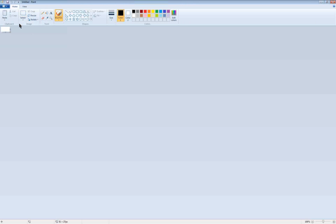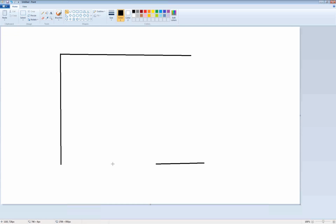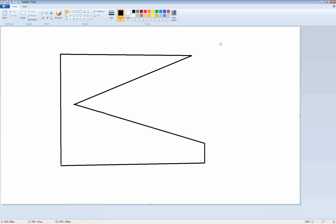So if you have a part, for example, let me just sketch this out here quickly. Something like this, and something like this, and we come to a sharp point like this. In my awesome CAD system here, say this whole part is like 1 inch long, and this represents my 40 thou waterjet stream. As I'm coming down into this notch, if I don't turn geometry optimization on, it's going to go all the way down till it sees its 20 thou standoff from this point here, which means it would actually end up digging into your part.